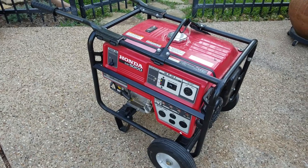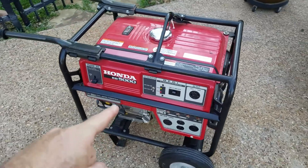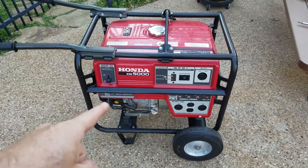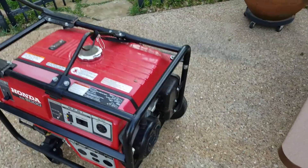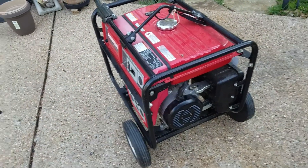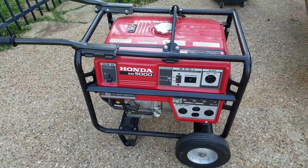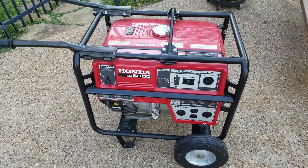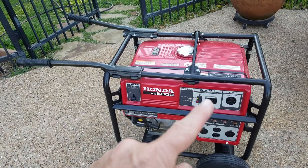I found an old two-page bulletin online. It said this thing is OSHA certified to produce GFCI-safe power when you're working out on a job site — cutting things, cutting wires, working in water. It's a good design, by the way, but if you want to power a house, it already has a ground system. You can't have two ground systems — a house and this.